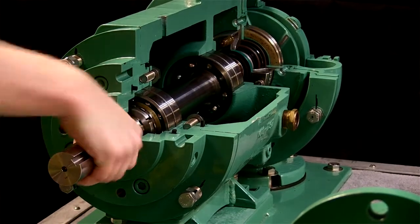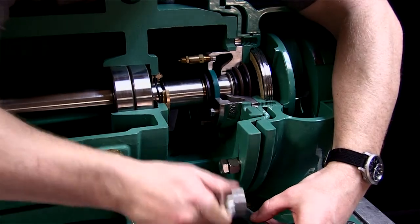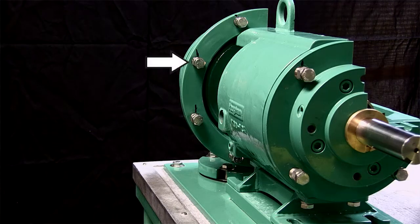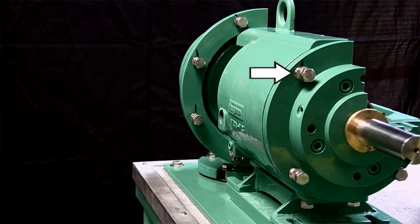In this video, we will walk you through the procedure for performing external adjustment of these clearances on Vaughan HE and PE series horizontal and pedestal pumps. These chopper pumps have an adjustable back pull-out casing design that allows external adjustment of pump clearances — impeller to cutter bar clearances at the pump suction and impeller to upper cutter clearances around the mechanical seal — without pump disassembly or disconnection from piping. There are two sets of external adjusters: one set for the impeller cutter bar gap located on the casing backplate, and one for the impeller upper cutter gap located on the thrust bearing cartridge.